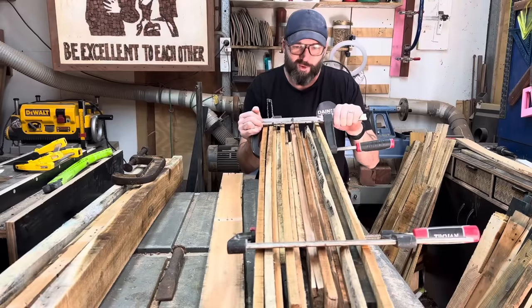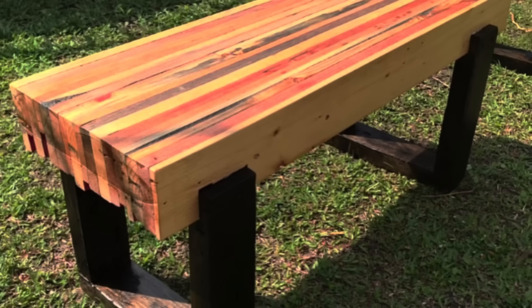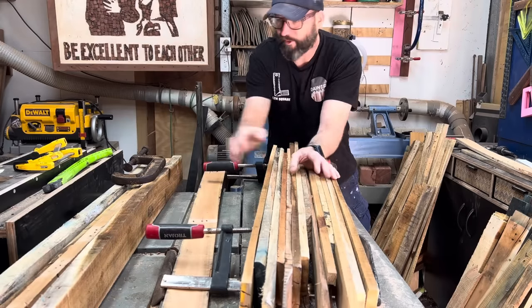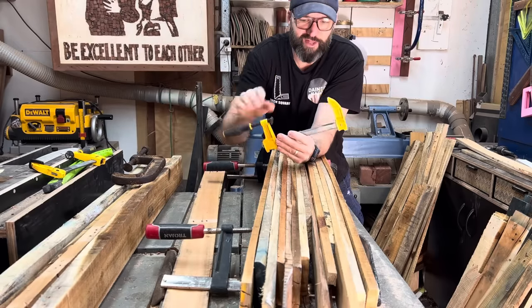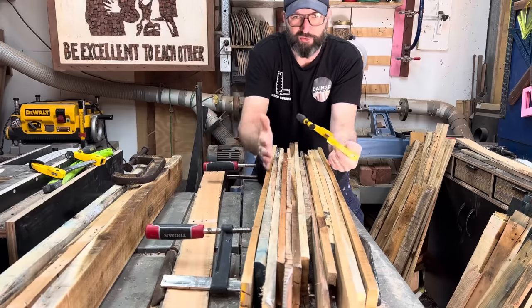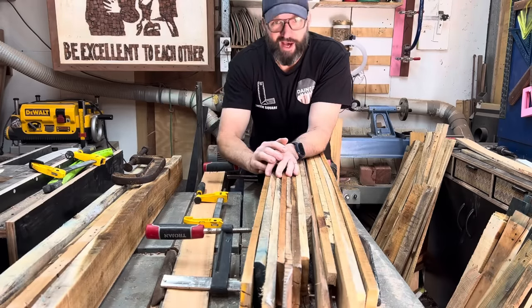This is what my first slabs look like. This would be the underside — as you can see, all the different widths of timber. And then we'd have the good side, which is the side I would flatten off with the router. Initially all I had was a heap of cheap and nasty little F-clamps. I could only clamp together about four or five slats of pallet wood, then clean those off and join them before I even had a router sled. That was very much the hard way — I would hand-plane off that first edge to get my very first piece of timber.